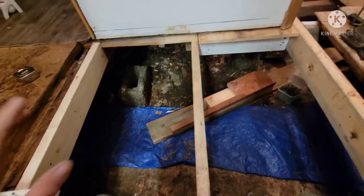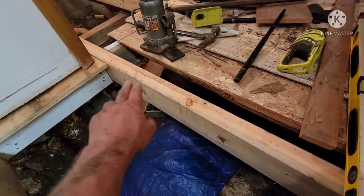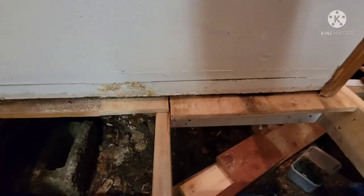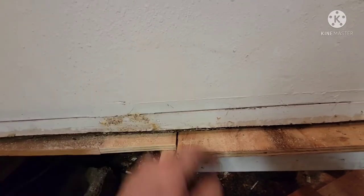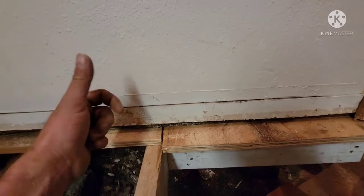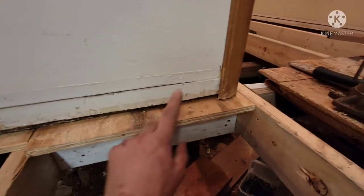Here's where I'm at: I got my boards cut to lift the floor joists and make them all run even with each other. I've got this board scabbed in so it's level across. I put a five-eighths plate underneath the wall and a three-quarter plywood under the wall - I filled the gap where the floor is supposed to be underneath the wall. This one actually runs all the way that way and is tied into that floor over there to give it strength. There's another board underneath pushing up on it in there taking the load on this wall. This is now fully secured - this sucker's solid, it's not going anywhere.